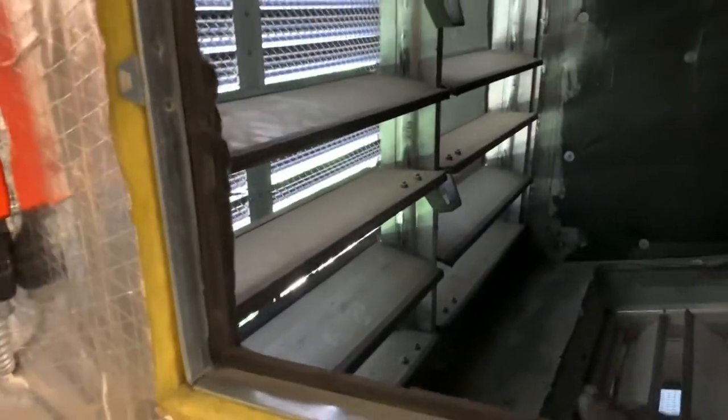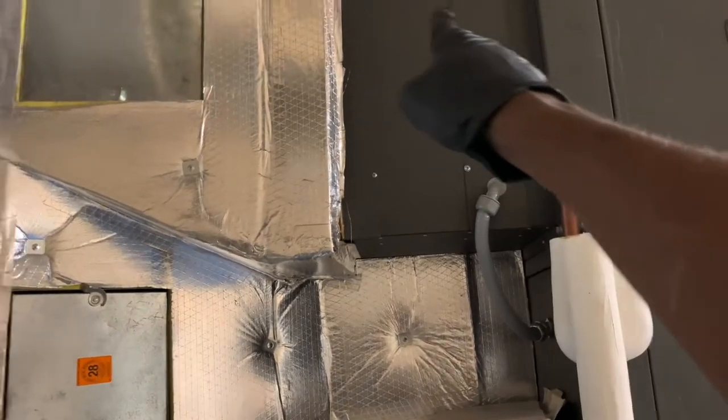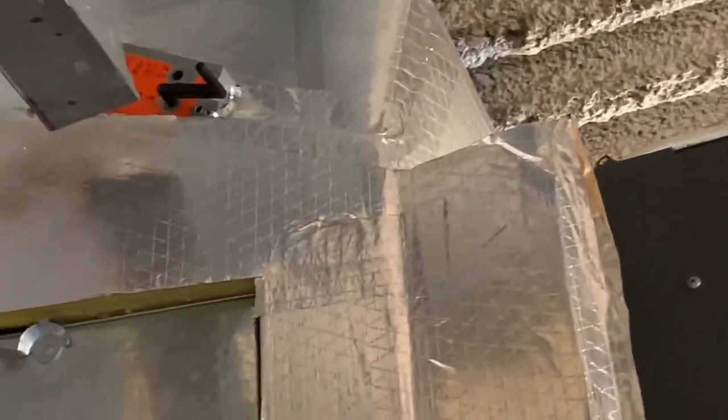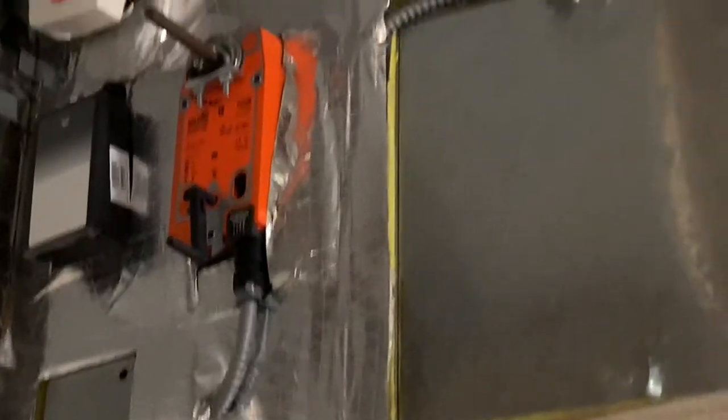The reason why I'm going to be accessing the factory or technician menu in this unit is because of COVID-19 — the client wanted more outdoor air to come into the space, more fresh air. Up top there is your return section. That damper, that orange Belimo — the cooling just cycled off and it's closing right now. That's the condenser intake damper, your condenser coil. That's your return air damper right there.